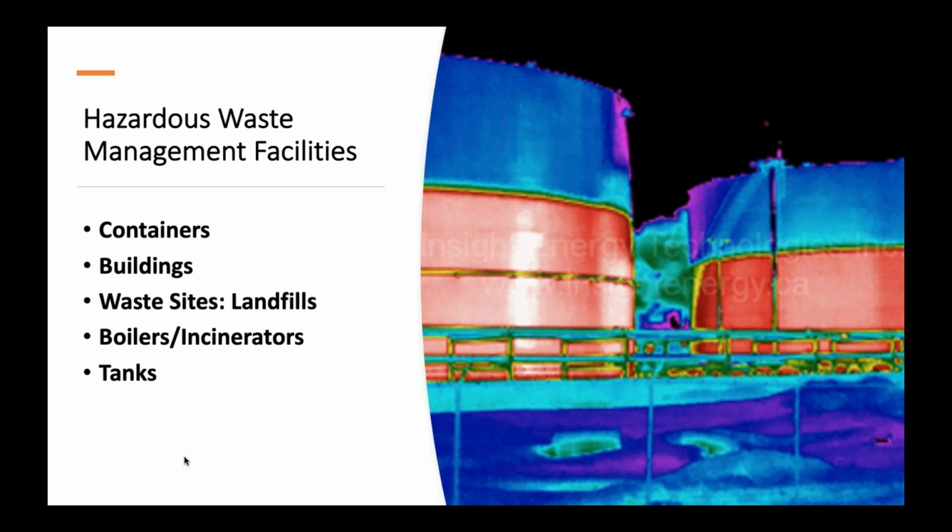And by the way, a lot of them are not monitored. We had a system at Charlotte Douglas International where a trucker pulls in to load his truck full of fuel. And this is, Ryan, you'll appreciate this, the value of having somebody on the other end. They had a heat detector that would discharge all this foam if it picked up a certain measurement. Well, the truck regen, those of you who drive trucks know what a regen is. It's burning off all that carbon. And when it regens, it reached 1,000 degrees. Well, the Motiva system said, oh, 1,000 degrees, discharge foam. There goes $1 million worth of foam because the trucker was regenning his system while he was filling up. That's not good. That's a waste. Now we have to get that foam back in, the environmental impact. That's why you need somebody watching it.